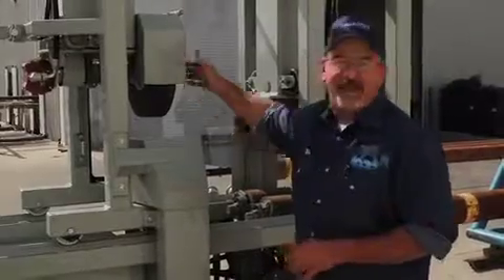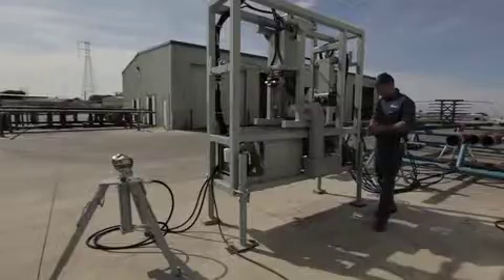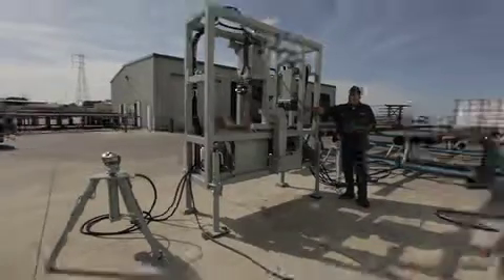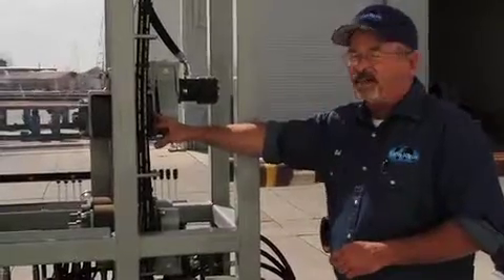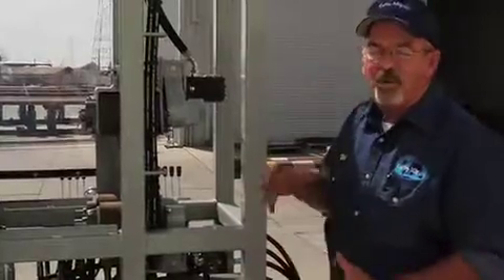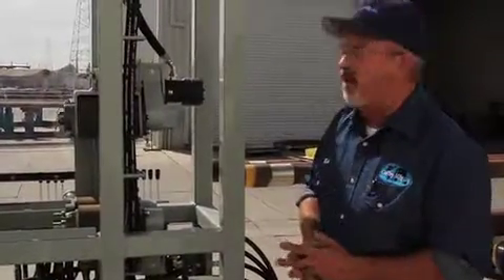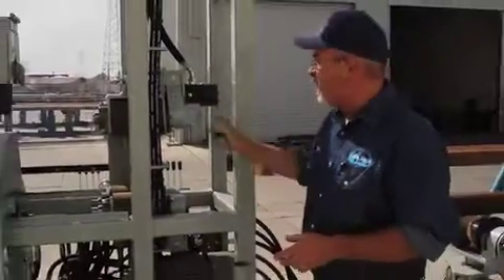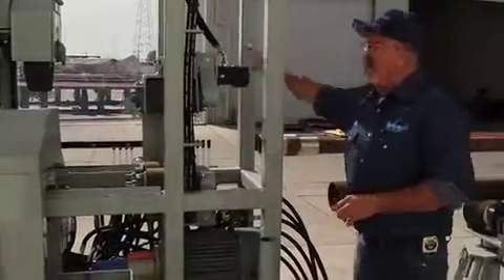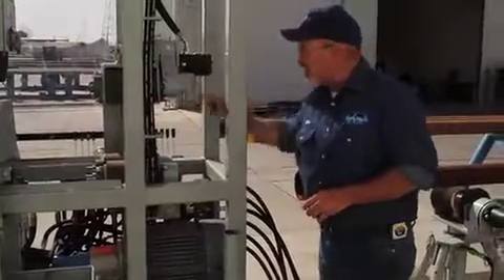We have our guard over the top of the grinding wheel, and a lid that opens up for changing out the wheel. Looking on around the machine, you can see the drum rollers right here. They are a six inch OD drum roller by eight inches long. They are rubber and hydraulically applied. We're pinching the pipe with four rollers, guaranteeing that that pipe is going to rotate no matter how wet, dry, or nasty that pipe is — it will turn. We have hydraulic motors driving the upper and lower rollers via chains, and we have our guards in place.